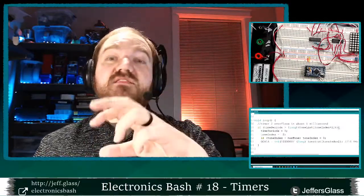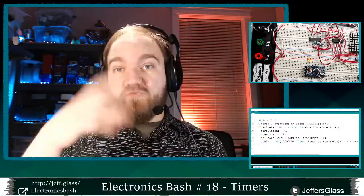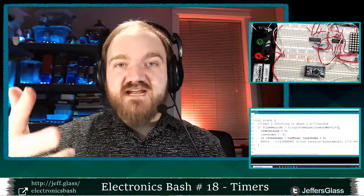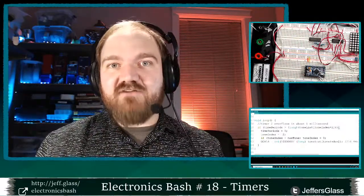So you wouldn't necessarily be generating the sound in, say, a Sega Saturn directly in the processor itself. You often would have an outboard chip, and your processor would say, okay, now play sound 31 every 56 milliseconds and loop that until I tell you to stop. And on top of that, play this drum sound every 112 milliseconds and play that indefinitely. So they had a sort of structure built into these dedicated sound chips.